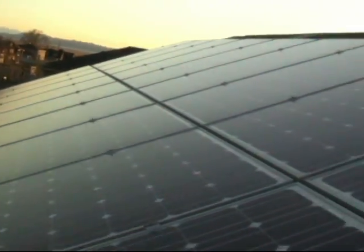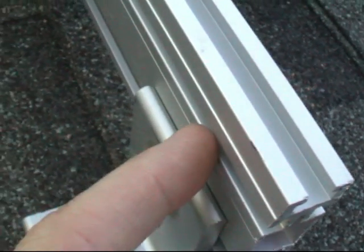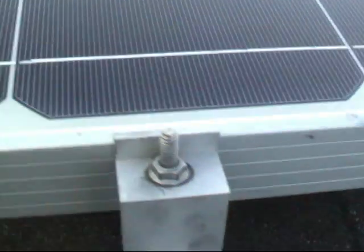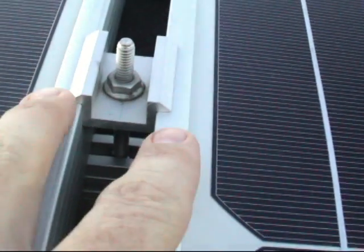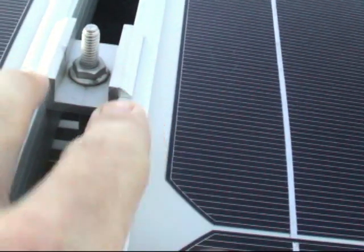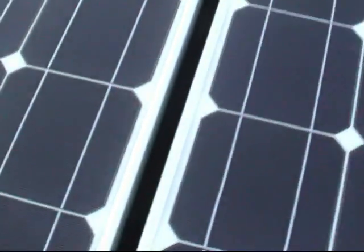There are 26 panels in all, 240 watts a piece. This goes into the truss and that's bolted on here to this rail, which they call the racking. This little bolt kind of twist-locks into this groove here and gets held down on that side. Over here on the other side you've got this other kind of mounting — it's meant to hold two panels down. It holds down by the racking, ties on here and sinks it down. Very simple, elegant design but it holds down beautifully.